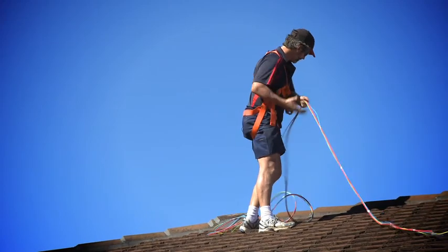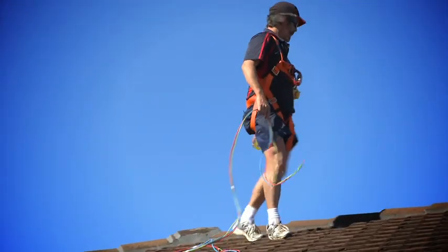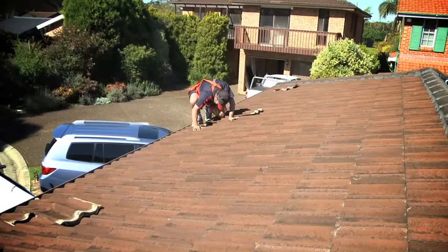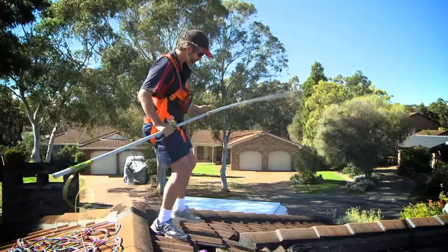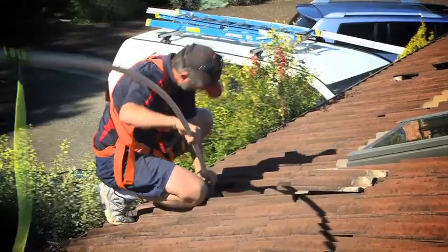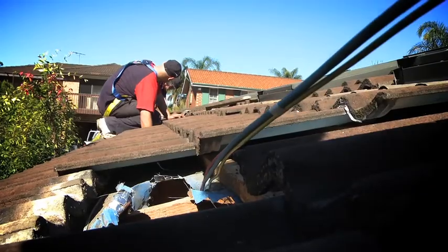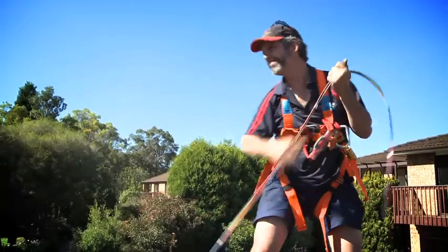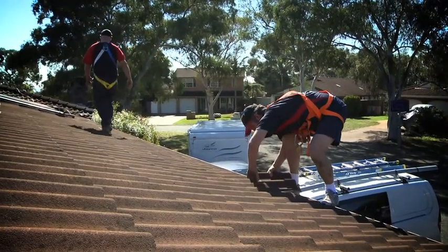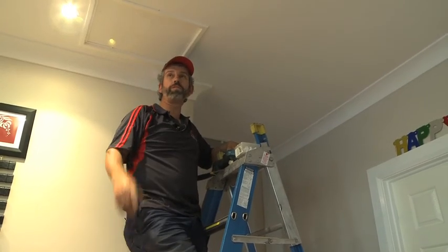What I've got here are my two DC cables — the positive and the negative — plus an earth cable that we bring up as well. What I'm doing at the moment is starting to run these in the roof. I've got a spot down along the side near the gutter in the eaves, so I can use my conduit here to just slip it along and run the cable through that part. Once I get to the corner down the bottom here, I'll have to get inside the customer's house through their manhole and run the rest of the cable around to our exit point underneath the panel.